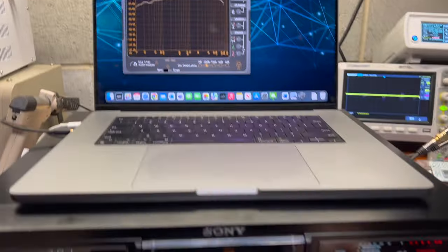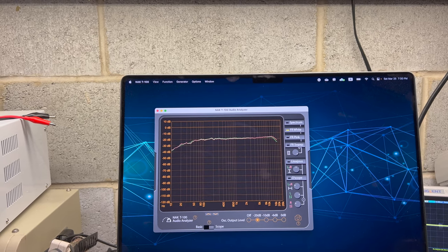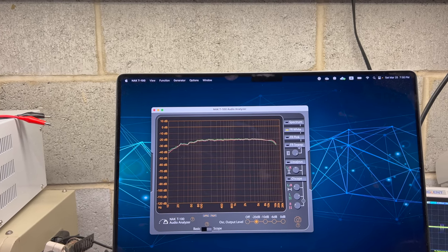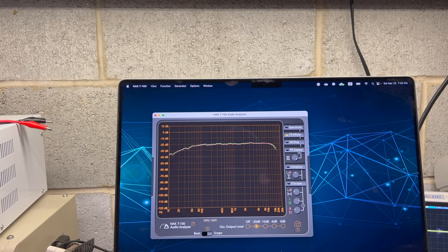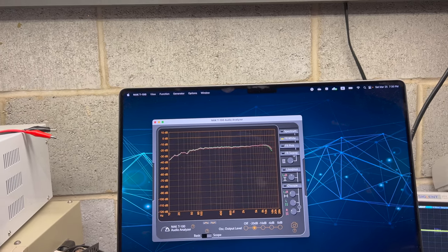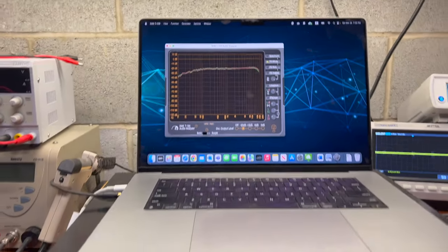And here is a front panel bias adjustment. So we can adjust it a little bit higher, if you like, or quite a lot higher with bias, or reverse, reduce bias. And here is a middle. Good. And level is plus 2 decibel, release minus 2 decibel. Okay, it works from the front panel.